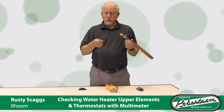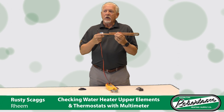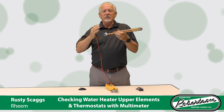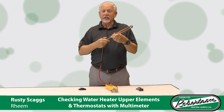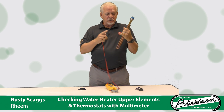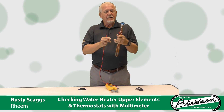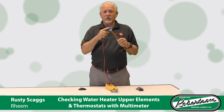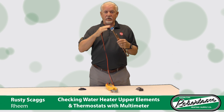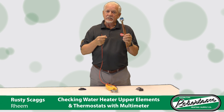Take your two probes, disconnect your wires, touch them to those two terminals on your ohms setting. Across a 4,500-watt element, you should read around 12.8 to 13 ohms. Anywhere from 11 to 16 ohms is a good range, so if you're falling inside there, you're good. There's also a formula: take your voltage — in this case 240 — square it, which gives you 57,600, then divide by the wattage of your element. If it's a 4,500-watt element, divide by 4,500; if it's a 3,500-watt element, divide by 3,500. That tells you exactly how many ohms it should read, and if you're within plus or minus a few of that mark, you've got a good element. That's the best way to test them. Thank you.